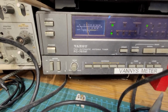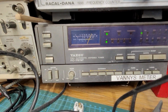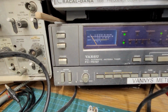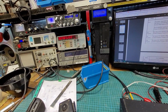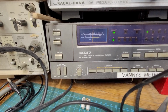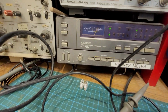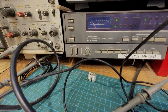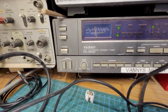Looking at the middle scale, 2 watts. This is 12 o'clock on FM, 10 watts. And that's full bore on FM, 10 watts as well. Let's see, AM, minimum power. Go 12 o'clock. Go to the higher scales, we're looking at the top scale now. Turn it up now. 1, 2.